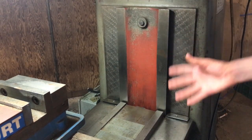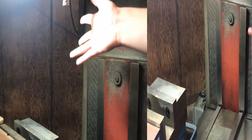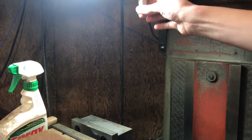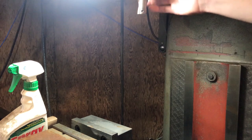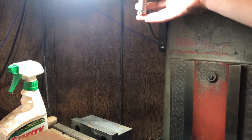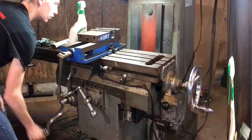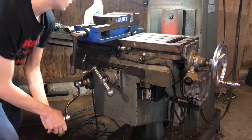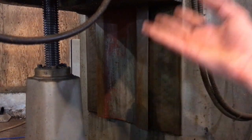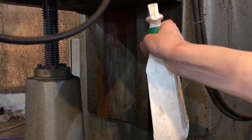Alright, that's pretty good. Now we'll crank the whole Z axis to the top and clean the bottom part. One thing we don't want to do when cranking the Z axis and table up is hit the tool — you could just remove the tool and that'd be fine. On this machine the air power drawbar doesn't work; there'll be a future video on that, so we'll have to watch out for that. Now we've got the Z axis cranked all the way up so we can work on the bottom of the Z axis ways — same procedure, just Spray Nine and a wipe down.